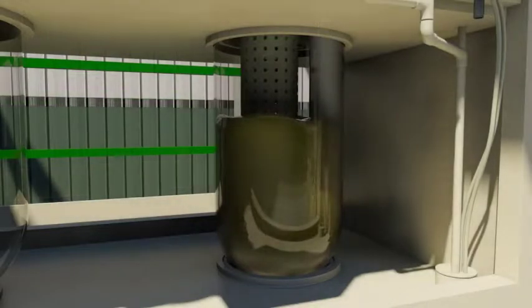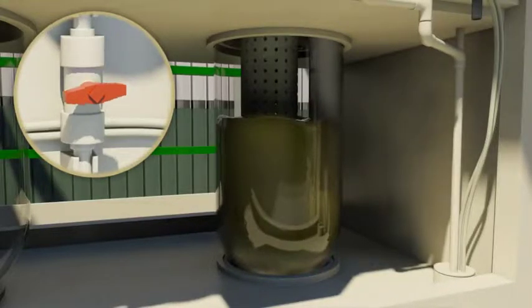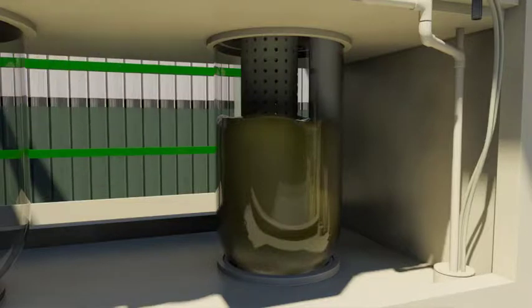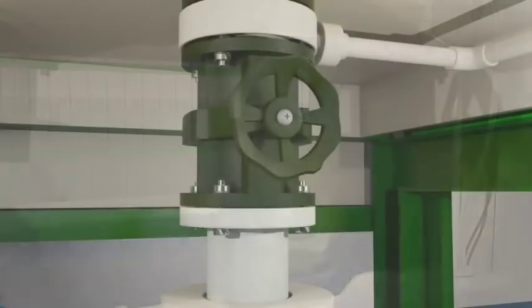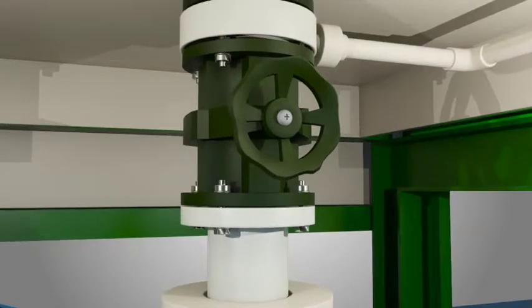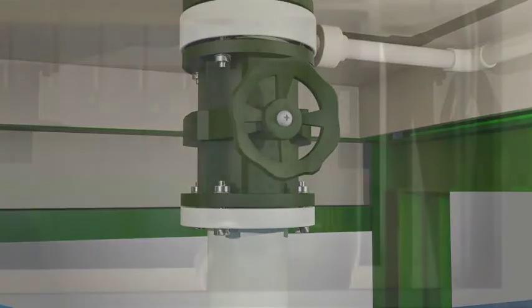The filter for silver chloride is then checked and connected. The discharge valve, as per the indication on the front panel, is opened for the circulation circuit within the filter and digesting vessel. The filter is connected with the discharge valve outlet of the digesting vessel, whose nozzle is ensured to be fit inside the filter nozzle, which is then locked, and the fumes outlet connection to the scrubber is also ensured. Slowly the discharge valve is opened and then quickly opened completely. All the silver chloride crystals form a surface on the filter media.